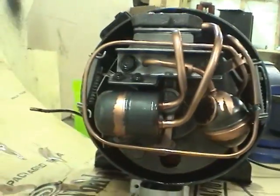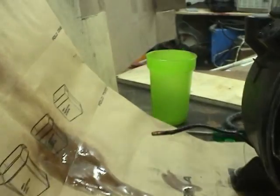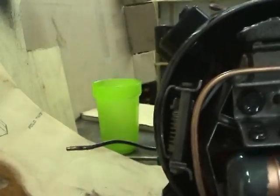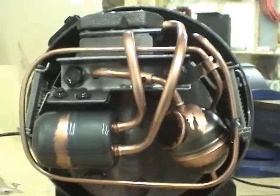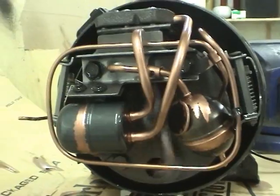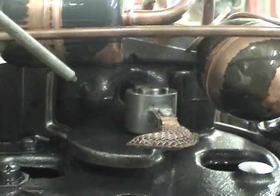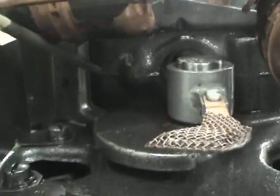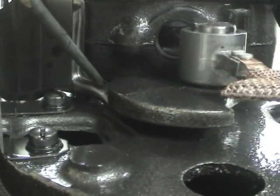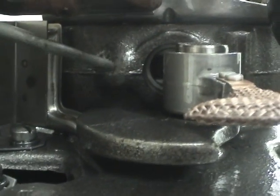Let's give this thing a run. There's quite a bit of oil in the exhaust. I'm thinking that when I first turned it on, that big spurt of oil that came out was probably stored in one of these reservoirs and just came flying out. The oiling system in this compressor is actually quite ingenious — this dipper flings the oil up onto the bottom surface of the compressor housing here, and some of it drips down over to the side and falls into this little tray.